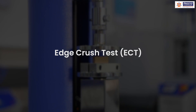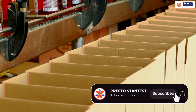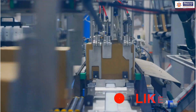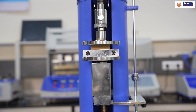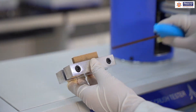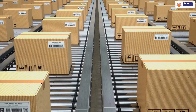Another equipment is an edge crush tester, important for manufacturers of paper and corrugated boxes. In the corrugated sample we have plies and flutes, and it is important to check the quality of these. Both vertical and horizontal compression strength are important. An edge crush test checks the compression strength of the edges of samples — verifying that the plies and flutes are capable of being made into a box. As per ISO 3037, this equipment measures the crushing strength of the edges of corrugated boxes, which is crucial for stacking strength.